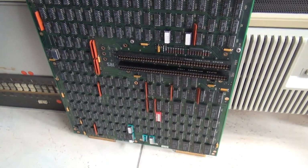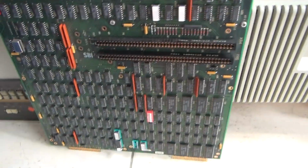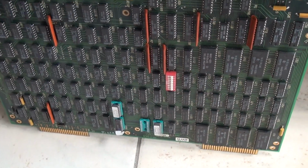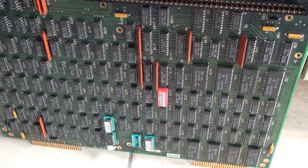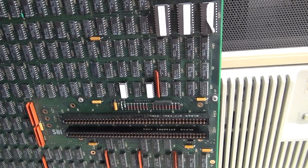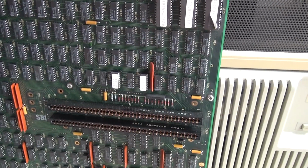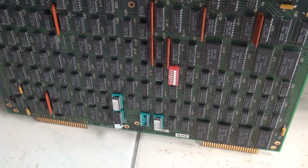This CPU comes with integrated firmware ROMs, so we can see them here. They're not like the EEPROMs in more modern machines; these are actually 4-bit PROMs. The chip inside consists basically of a diode array, and the programming device just burns diodes away. That's not like in an EEPROM with the floating gate, it's really burned in there. If we would open one of these, under the microscope you should see the burns.